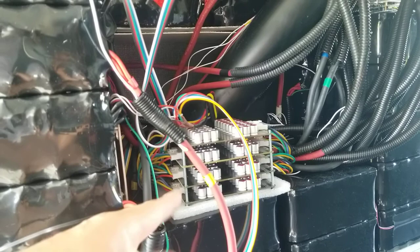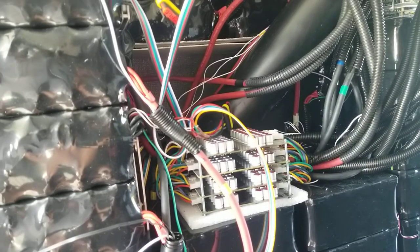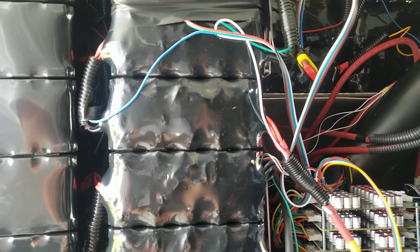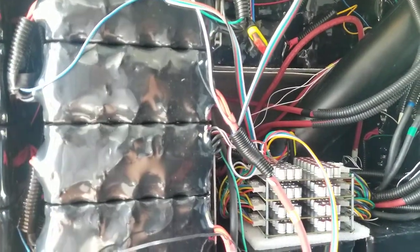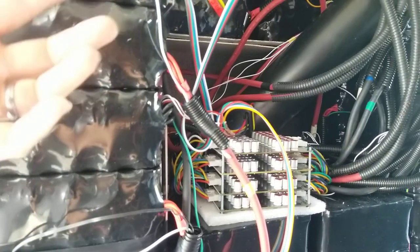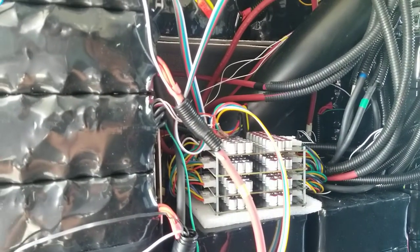But if it was, it would be auto-corrected by the active balancing. So even if, you know, they're all 100 amp hour cells, except for this one's only clocking in at 50, if that were to happen, then with the auto-correction there, that would be mitigated throughout the entire pack, and you would not really see it, especially with the speeds of the systems and the way that they work independently, as you can actually have one pack a few volts above or below another pack, and they'll just be equalizing. So they do work independently to within a certain limit.